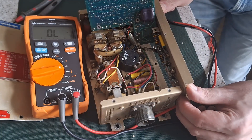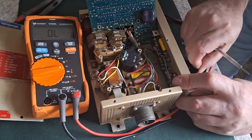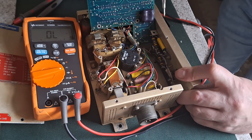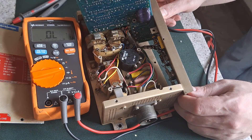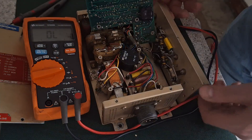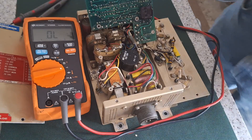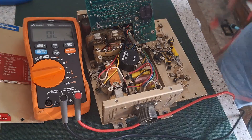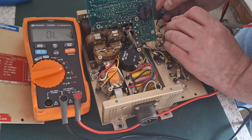We've got 2N6484 and 2N6284 again. I presume one will be PNP and another will be NPN. There's a lot of 2N6284s, so I think there's probably only one transistor that works. Those 2N6284s are actually Darlington transistors, so that's why you're not getting a diode reading collector to emitter — sorry, base to emitter.